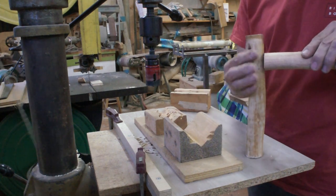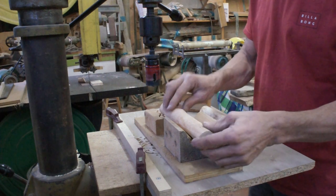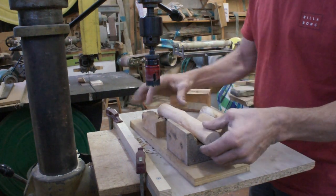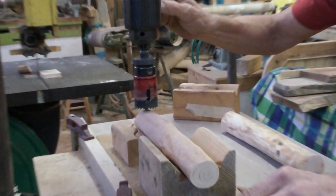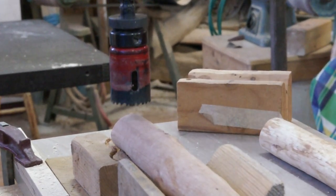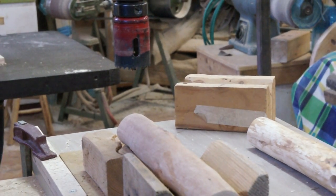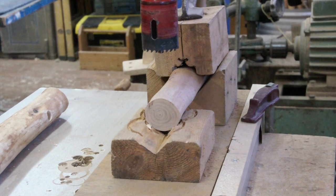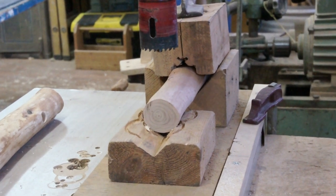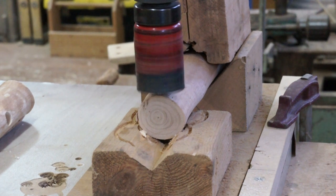Come over with me to the drill press. I want to join this stick to this stick and I want these unsightly corners out of the way, so I need to make this round to fit this one. I'm going to pop it here in these two V-blocks. I've got this V-block with less wings on it so I can see what's going on, and position my drill on the end. There's a danger all this stuff's going to go flying around so I should really hold it all with a clamp. I'll put a little V-block on the top as well and hold this with a clamp. I'm going to do this on a slow speed because it's quite a large diameter bit and I don't want it to start smoking. Slowly, just to get the drill centered at the beginning.